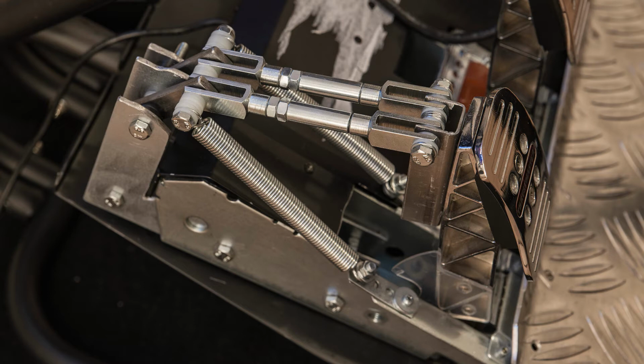Anyway, I would suggest if you go for a model like this, you take springs that are a little stronger than that, maybe 0.7 to 0.9 Newton per millimeter. In terms of length, my spring measures in at 132 millimeters, mounting point to mounting point in relaxed state. Since this is a little on the low side, I used a hole ribbon to extend the spring length to reach the holes pre-drilled and pre-threaded in the pedal base in a rather relaxed state.